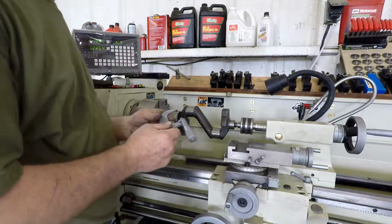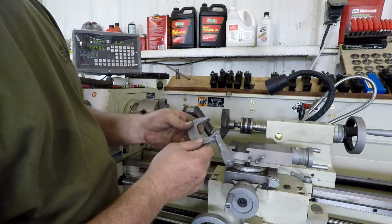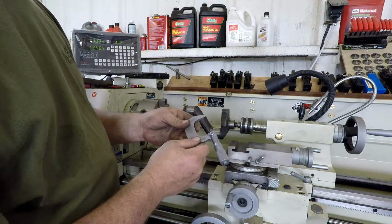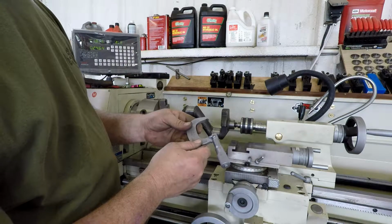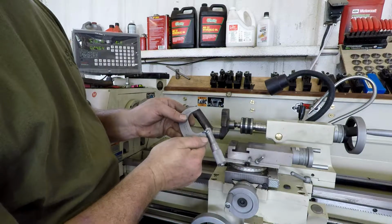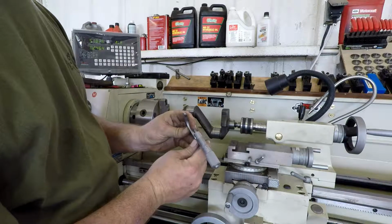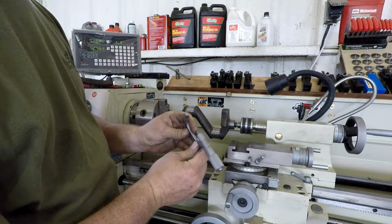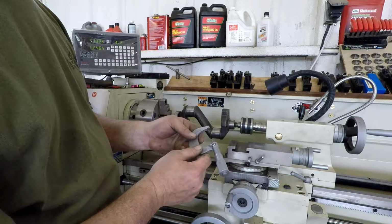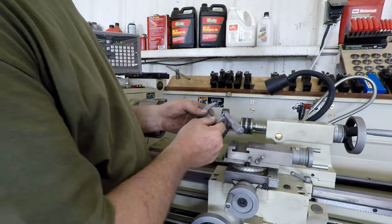Let's just see what that number is. I didn't bring any glasses, so we'll just have to take a minute to read it. Alright, we're at 1.623 and about a half. Yeah. 4/10 over, so it's really right at 1.623, a fat 23, 1.623.